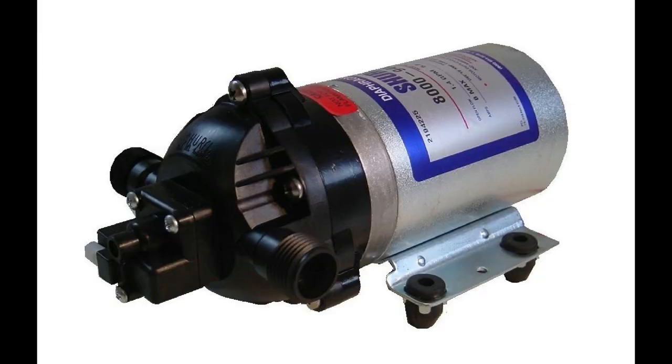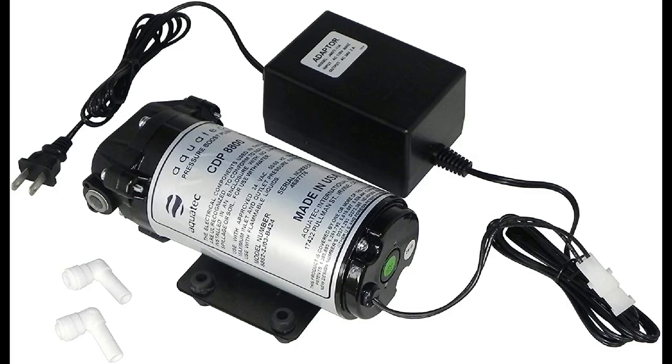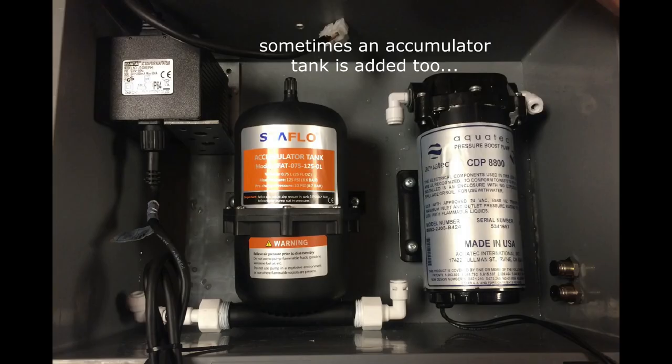Proper systems should also be made with PVC pipes for the water lines and use high-pressure water pumps. These pumps are way heavier duty than typical submersibles, and they should be — because they have to push 80 to 100 PSI or even more if you have a lot of misters.